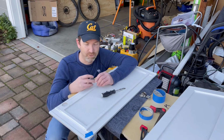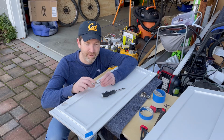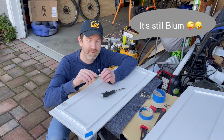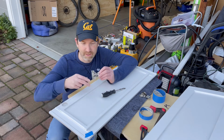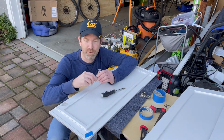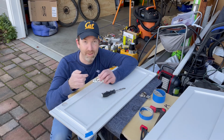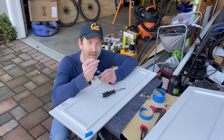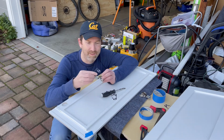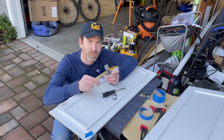They're so close. So I did find these Blum hinges, it's the brand, and then it's a European style hinge, which goes into this pocket hole, and it even has a soft close, which is really a nice feature. In any case, even with this, finding a lower profile, it still was too thin, so I had to pay crazy money for a spacer, and I think this almost came close to the price of one of these.